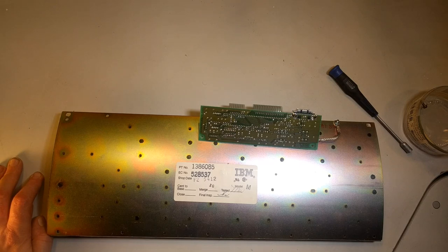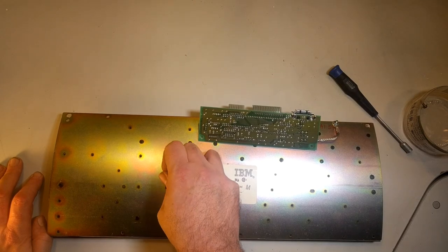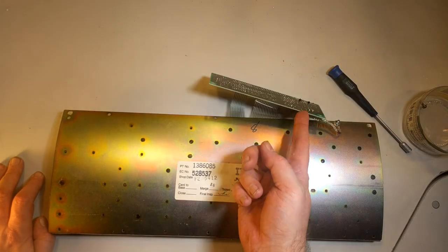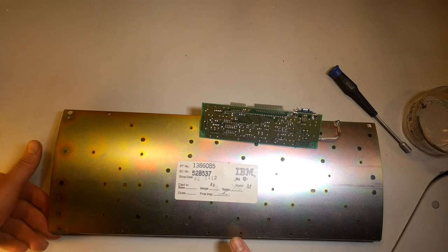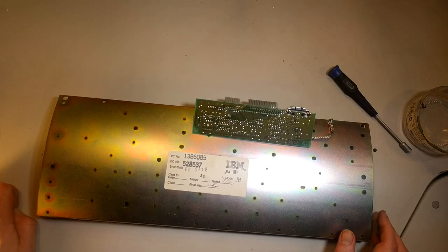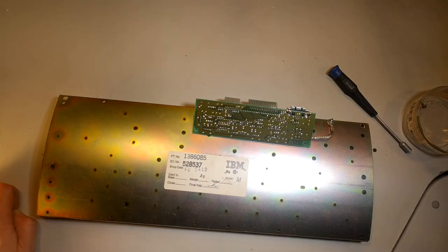So what we want to do is replace all the rivets. We're going to take all these rivets off. They'll probably come off on your finger. No, maybe not. We'll use a chisel, but there are very few of them left, and we're going to drill through this plastic base plate. Then we're going to push bolts up through this way, and screw down nuts on top of it.